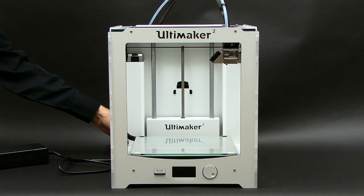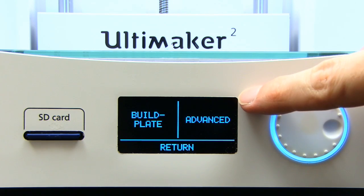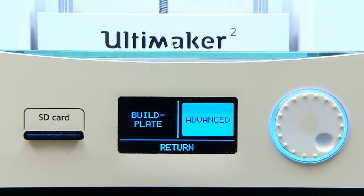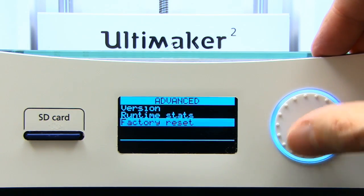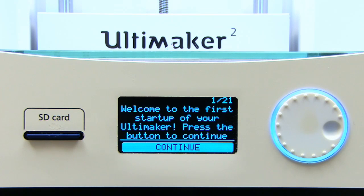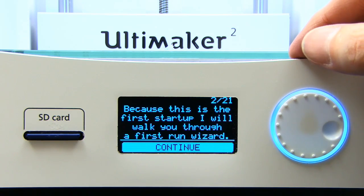With that done, it's high time to go around the back and turn things on. Our Ultimaker has come to life. As you can see, it's got a little screen to control it and a control wheel which you flick through options and press to select. Now this printer has recently been transported, so it's important we do a setup. I'm going to go into Advanced, all the way down to Factory Reset, and perform a factory reset. And it's brought us back to 'This is your first run — press the button to continue.' This is exactly what you'd see with a brand new printer.